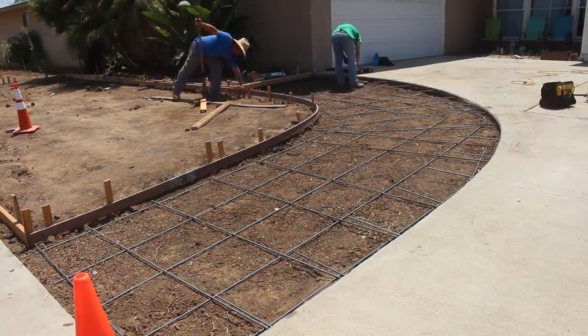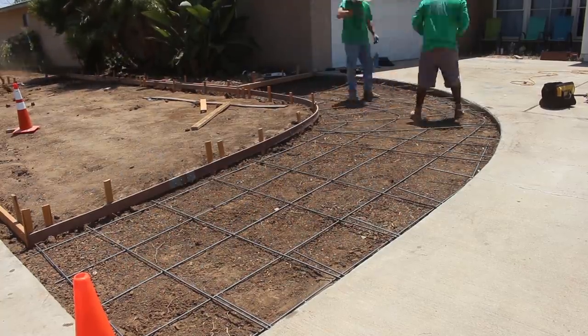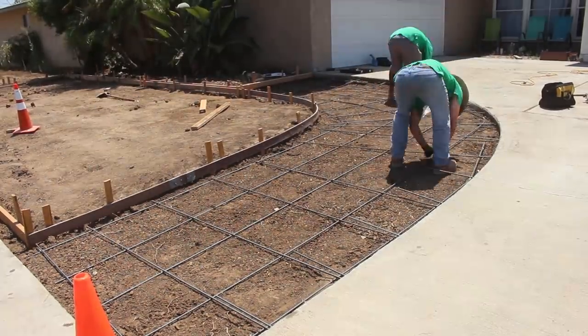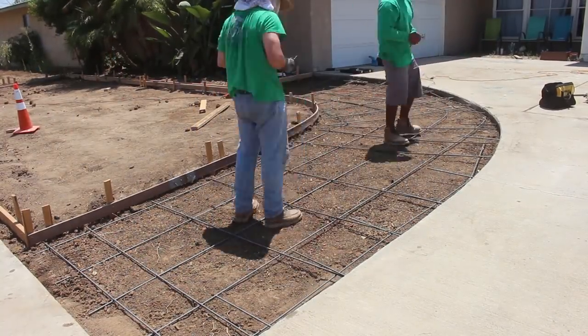And I have been using an epoxy system and over-drilled the holes. Yeah, we cut these bars 6 inches long, slide them into an oversized hole with epoxy in them, boom. But this drill and drive works just fine.